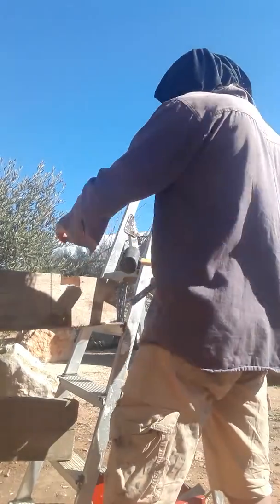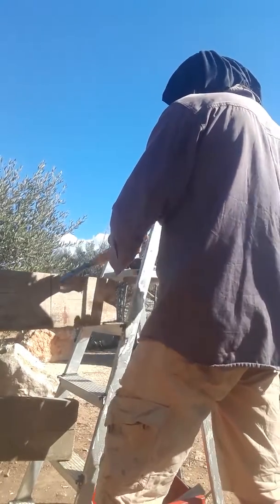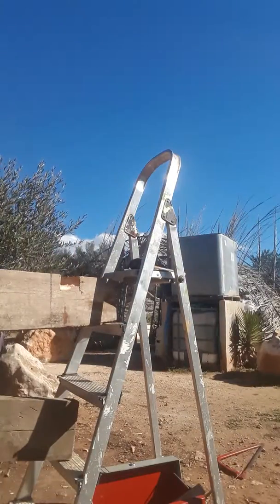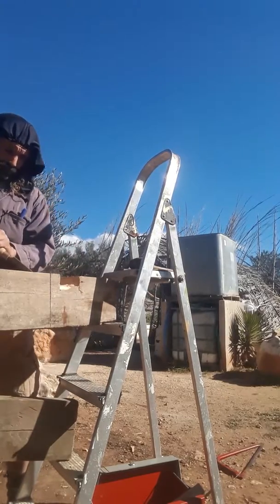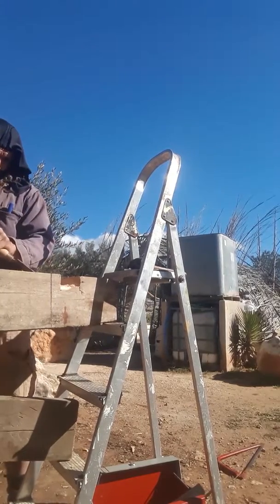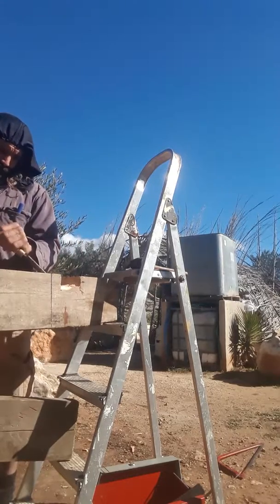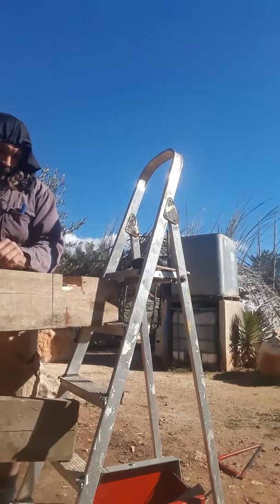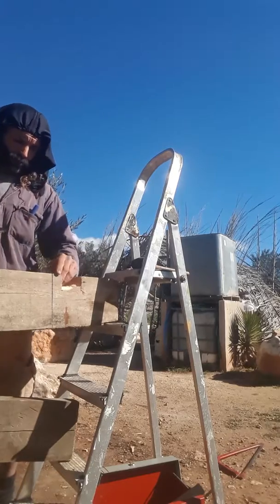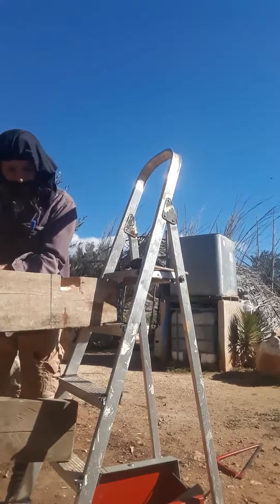This may well be an oak — just because of their hard quality and strength. But if you're going for outdoor structures in terms of resistance against rot and insects, you can go for sweet chestnut. I've done a few structures with sweet chestnut which are still standing without any preservation.